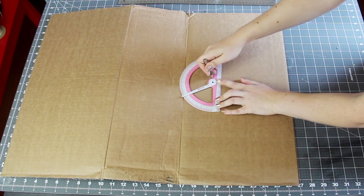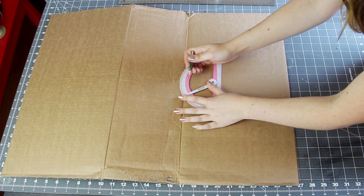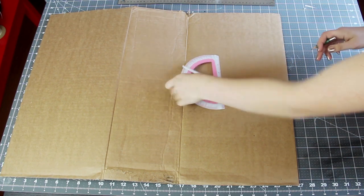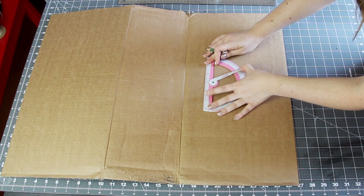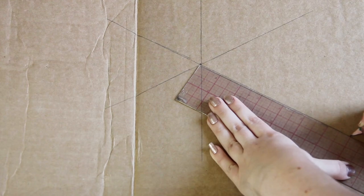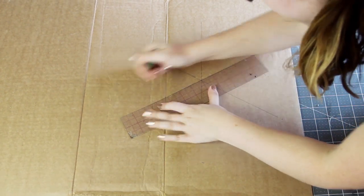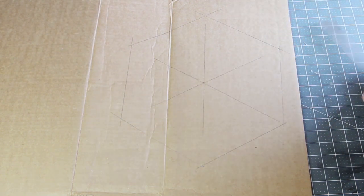So now it's time to draw out your shape. I'm gonna be making a hexagon shaped tray, but you could do a square, a pentagon, an octagon, whatever shape strikes your fancy. To draw a hexagon, just break out your math class protractor and draw some angles that are 60 degrees. Extend those lines out and then measure up the same distance from the center. For the larger tray I made, I measured 7 inches from the center, and for the smaller tray, I measured 4 inches. Then just connect those marks and you've got yourself a hexagon.